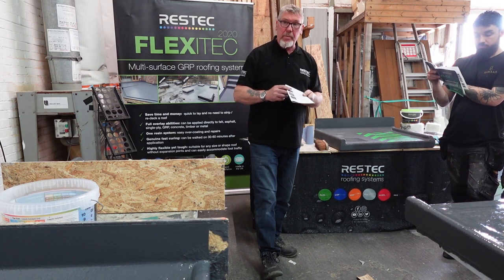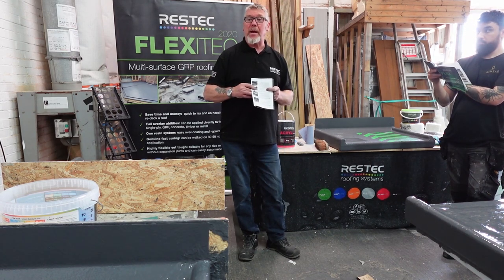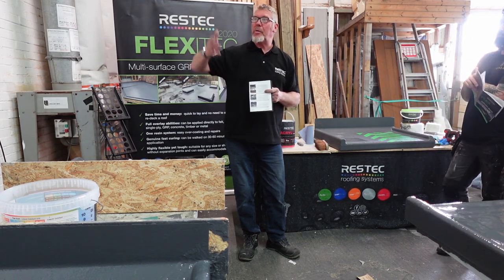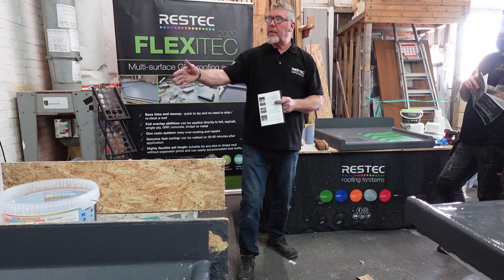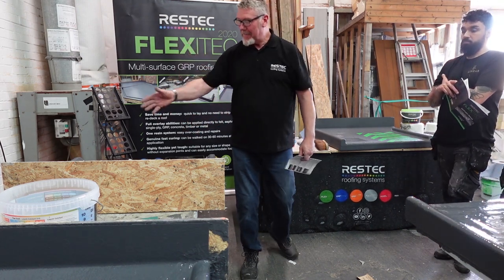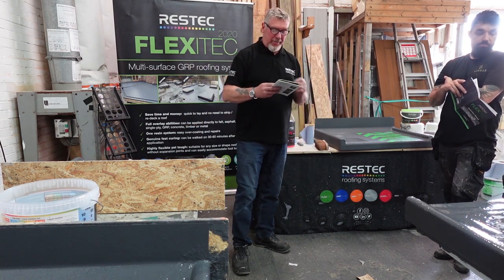Okay, concrete brickwork screed, so brickwork up the wall, no problem doing that. If you're going way up the wall, think about how you're going, can you get a bit of slumping in it. But I did turn your model on its side here and we turned it back down again. I turned it up there for a reason so you guys could see, even though it's that deep, it's not moved anywhere because you've put it down right.